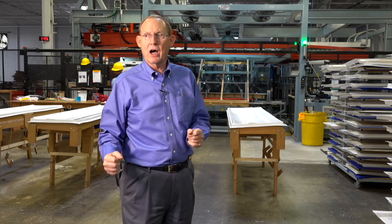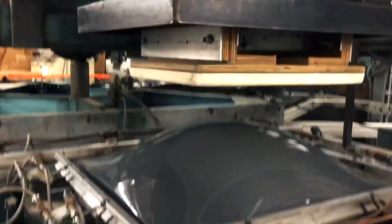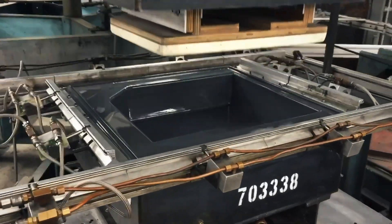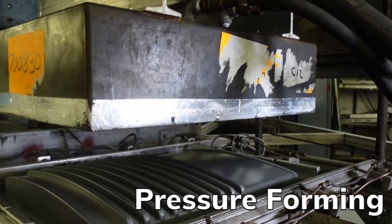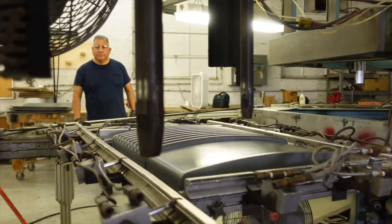All of this is vacuum forming. All of the material is heated, and then vacuum evacuates the trapped air. In some operations like this, we use a female mold, and we pressure form it. Pressure forming is the science of adding 120 pounds of compressed air to force this smooth material into this tool to pick up this pressure and this texture.